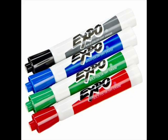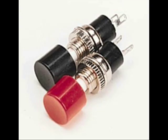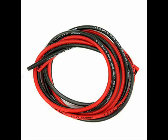In order to build your pen you're going to need the following components: a dry erase marker shell, an infrared LED, a simple two-prong momentary switch that doesn't lock, an N-type battery holder, an N-type battery, and some 22 to 26 gauge red and black wire.